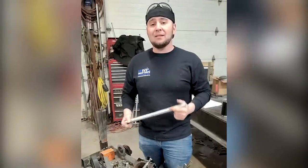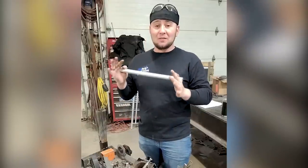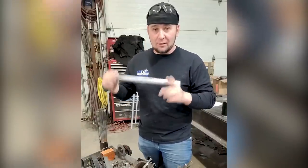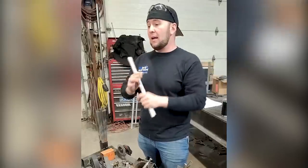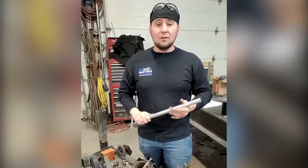And last but not least is tons and tons of scraps. The key to making these spiral staircases perfect is bracing. Bracing, bracing, bracing. Where you brace is really important to getting the good results of having all the pickets and posts in line with the main post. So rage your scrap in, grab some material, and let's start building.